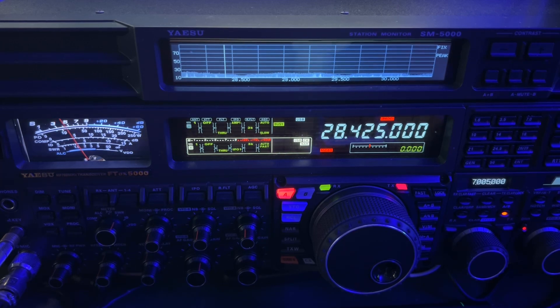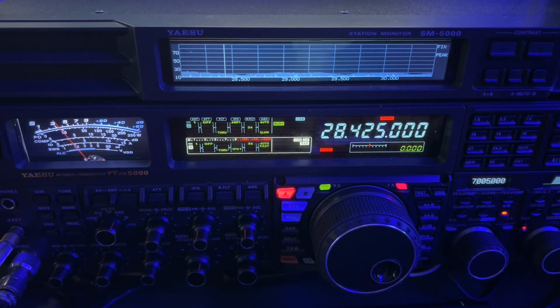If you've watched my channel for very long, I've shot numerous videos about various types of noise. These noise blankers are usually most effective against pulse-type noise, like from power lines or ignition pulse noise. They're not very effective against digital noise sources — things like wireless phone chargers, LED light bulbs, broadband digital noise, or switching power supply noise. So don't get too excited, but the noise blanker is usually effective against power line noise. That said, power line noise can get bad enough that the noise blanker can only diminish it, not knock it out.